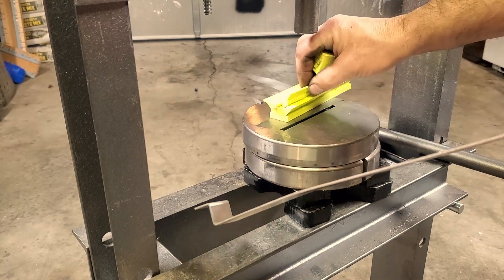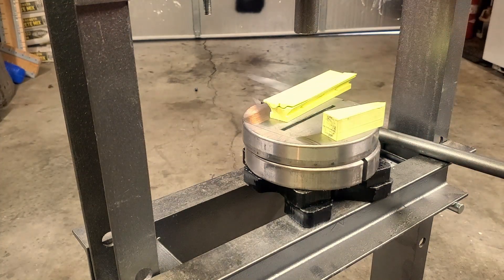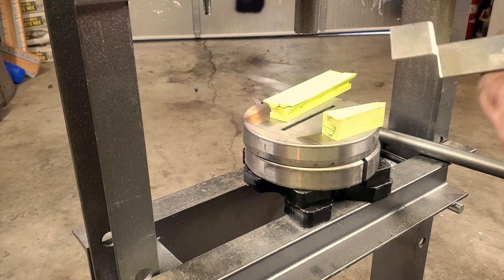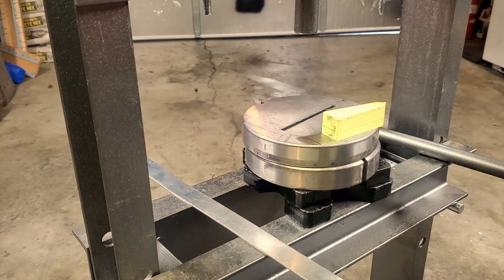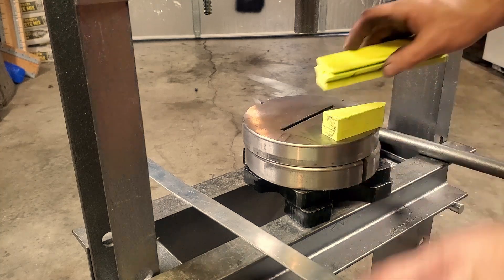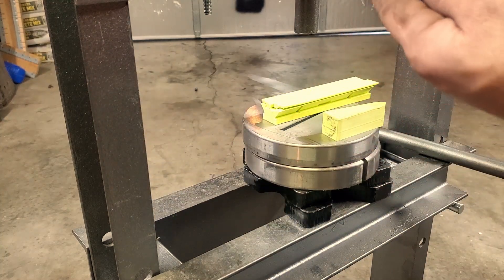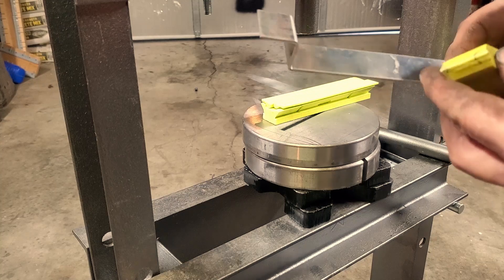I pressed it a little hard on that one — it's about the upper limit of the thickness capacity for this type of die. It squeezed the material out a little bit, but not too bad. I might just upsize this die a little bit; it's a pretty small die for bending. This is 0.080 aluminum, but even still it didn't really do any more damage to the punch than was already there.